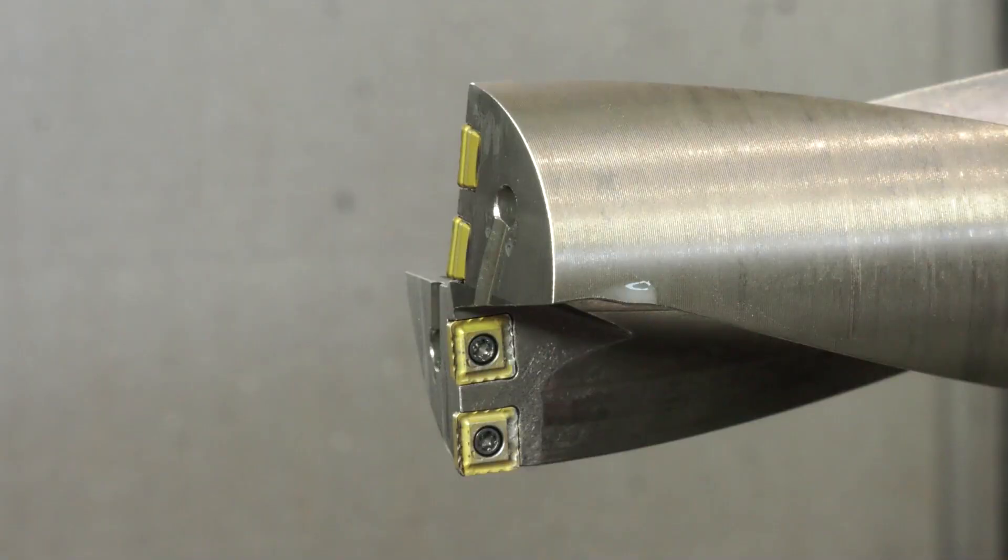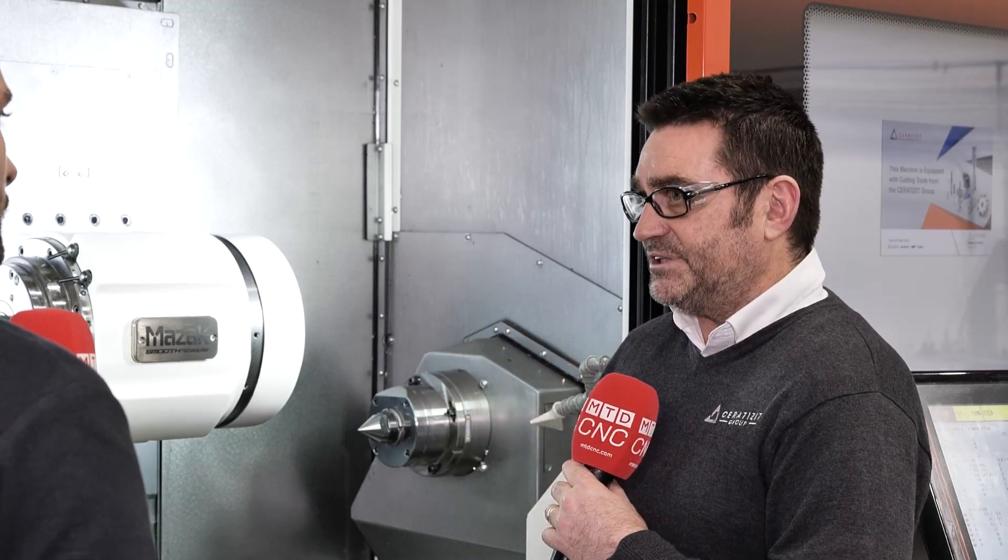Because of our knowledge in reducing cutting forces, using a sharper chip breaker — and if you look, it's got little dimples in it — this makes the swarf fold back on itself. It makes the chip smaller and more easily evacuated, enabling you to use a lower feed and chip the swarf using a lot less power. But even though you've got a lot less power, you've still got quite a high metal removal rate.